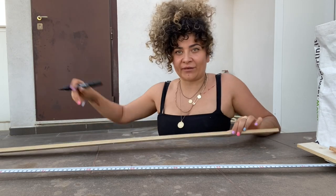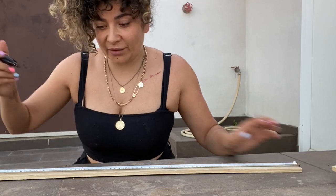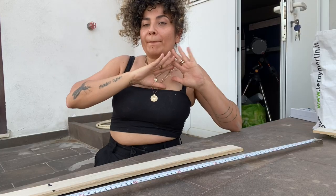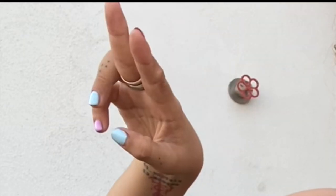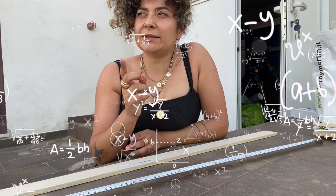We need three pieces of 50cm — since they're one meter long we just cut them in half. As always, the measurements I give are flexible. I decided to have two separate squares on top: one side with only one shelf, and the other side with two shelves. Because there is a line already in the middle, each side instead of being 50cm will be 48.63cm — that's what we're cutting.